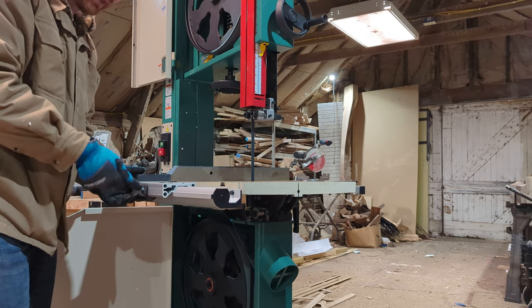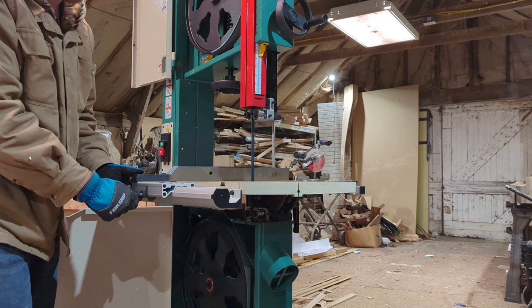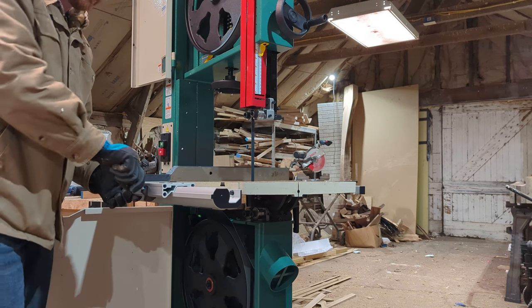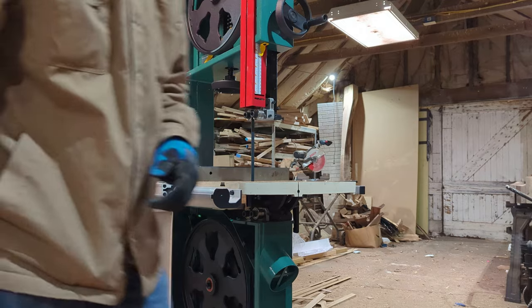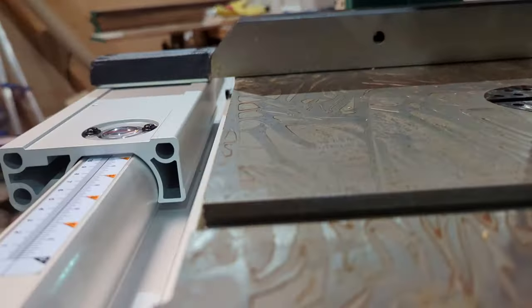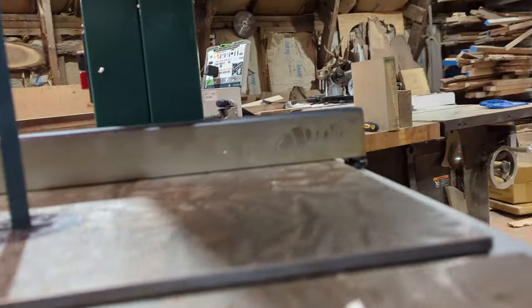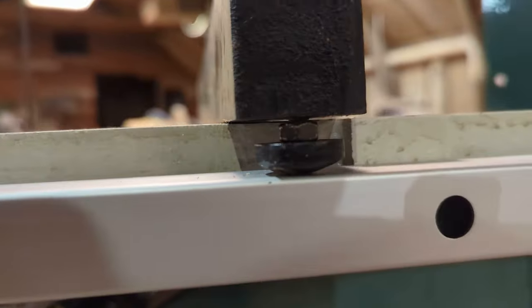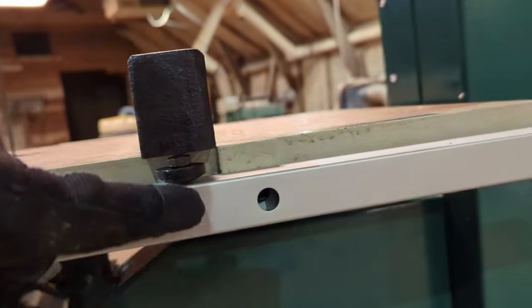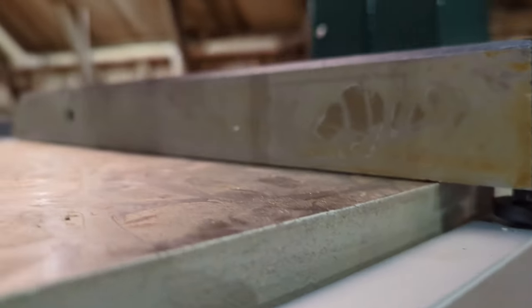As you tension this, it kind of locks into place. You can get it good and snug, and when you want it locked into place you pull it back down. The next thing you're aiming for is an even gap beneath the fence all the way across. To do that, adjust this little tab here — I had to lower it down a little bit to raise the fence up until I had a consistent gap all the way across.